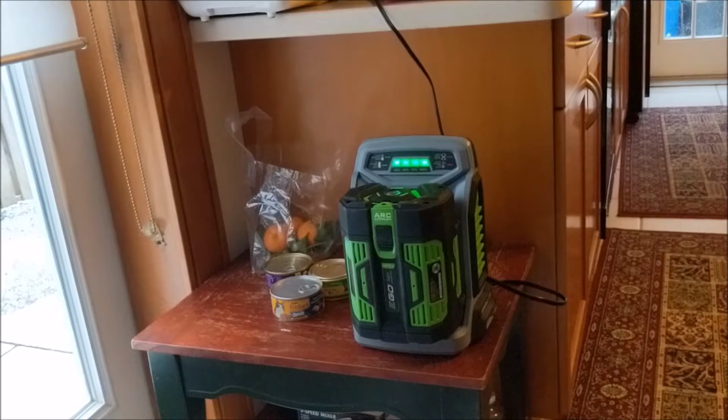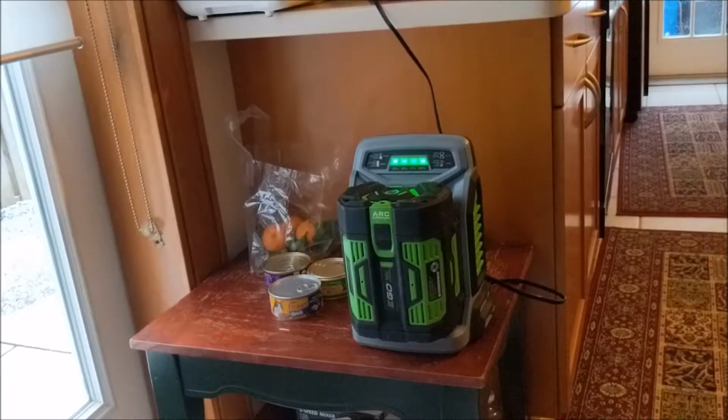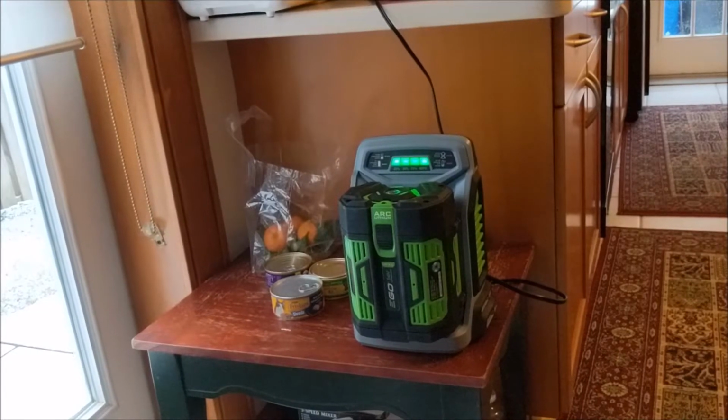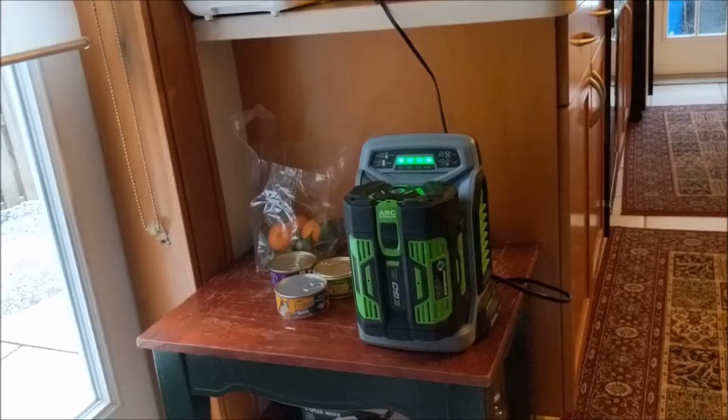Again, don't forget to periodically let the battery charger fully charge the battery until it shuts off, until this balancing equalization cycle completes. It's important, and if you don't do it very often, it may take longer because some of the cells may get disbalanced.